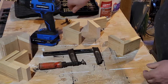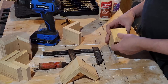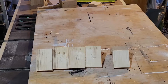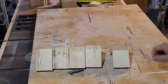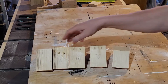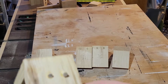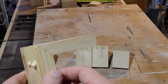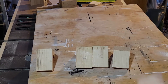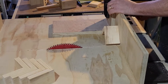So that's all done. Those are no longer necessary because these are already set up. All I'm going to do is mark them with the ruler and a couple of pencil marks and then drill the holes and set the pegs. So there you go — that is the 90. This is 7/32nds and these are the 15/64ths, so there are two of them. They are the larger of the drill bits so there's more glue around them, and hopefully that will make a difference. Let's get on to the tests themselves.